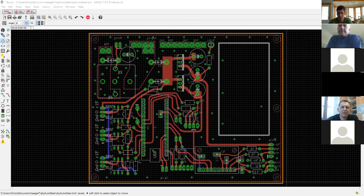I had started to develop a small PCB for myself as I mentioned last time, and now I have my first prototype sitting on my desk. My worst mistake was the wrong footprint for the I2C bus level converter, and the LDOs are getting warmer than I would like, so I need to redesign the board a bit.